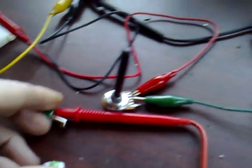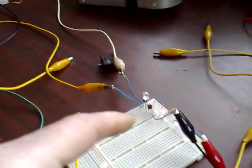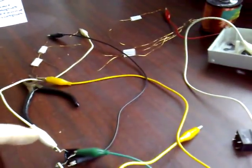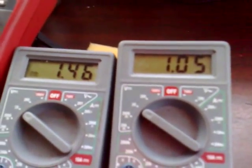I want to show you what the standing voltage on the bridge rectifier is. If I take that off there, the output from the bridge rectifier is 2 volts, so that's got a good chance of charging a 1.5V battery. What's interesting is the output from the actual voltage regulator without all this oscillation going on is about 0.9 volts. So by putting this bifilar coil in there, going into this bridge rectifier and connecting the negative of whatever you're charging to the negative rail, it boosts this output right up. I find that very, very interesting. I've not really done any tests with this yet because I just built it, but I'm showing you what I've got for now.